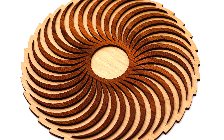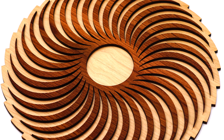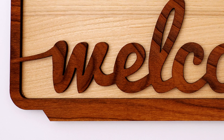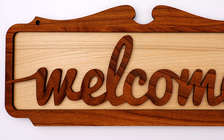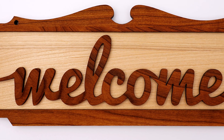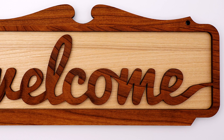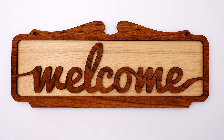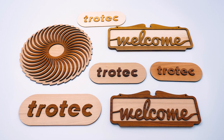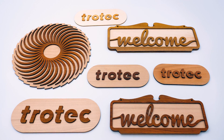Note that using different laser parameters and focus settings can also produce lighter and darker effects on the engraving process. High power and slow speeds will have a darker result, and lower power at higher speeds will create a softer impact into the wood. The focus can also be adjusted on the engraving for more burn and less grain effects should you like. Because there are so many looks and grains in woods and this process exposes the grains, every engraving will have a unique, one-of-a-kind look, making this an outstanding laser hack.